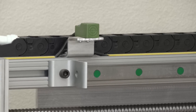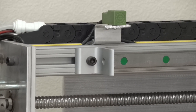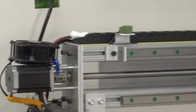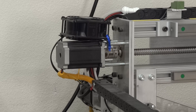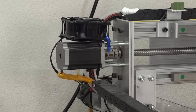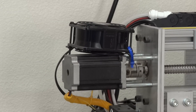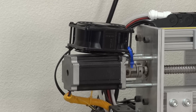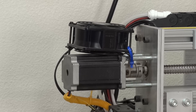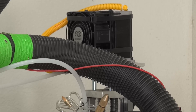Trust me — when I was learning how to use this, there were times that if I hadn't had those limit switches, I would have damaged my machine. The other thing to consider: the NEMA motors — the higher-rated NEMA motors — they're always on. Even if you're not using the machine, they're powered up and they create a lot of heat. You might want to consider having muffin fans or some kind of additional cooling, depending on where you put your CNC machine. If it's in an unconditioned garage, these are going to get awfully hot. I've put muffin fans on the NEMA 23 motors to keep them cool.